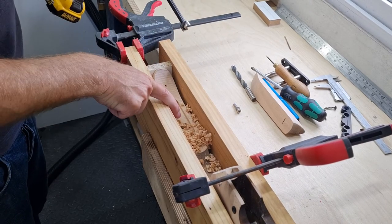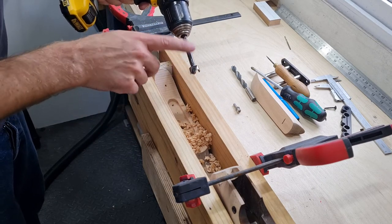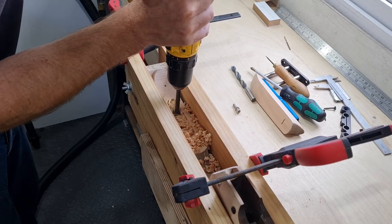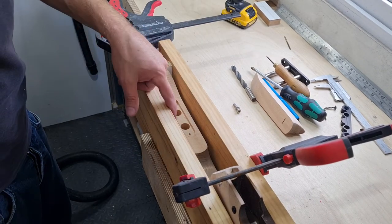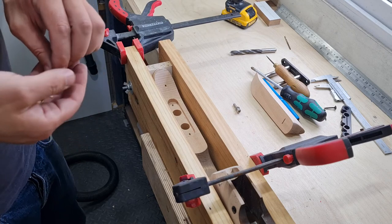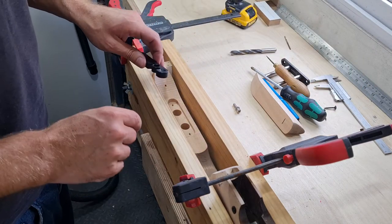Be sure you don't bust straight out the bottom of your stock. If it means putting a depth stop on, do it - or put a bit of tape around the drill bit so you can't go too wayward and skew out the bottom. That's giving me a good start - beautifully crisp and clean in there. Having decent sharp drill bits works absolutely beautifully. This is beech and I quite like the smell of it when working it. We're pretty much done with the stock body for the moment.